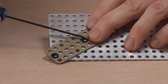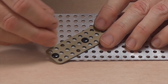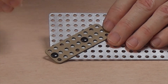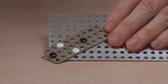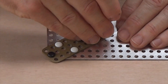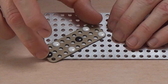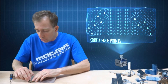It's 4 on the bottom and 3 vertically. The reason I'm showing you this piece is because I want to show you that there are actually confluence points between these two grids. If you think of this as defining one grid, and this 3x9 gusset plate defining another grid, you can actually find all these confluence points that I'm marking with the white quick connectors. This is very handy because it's easy to build things in Matrix where you have these kinds of relationships between holes.